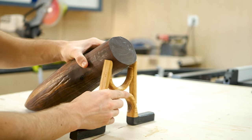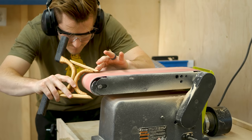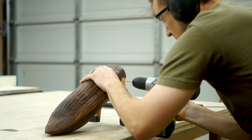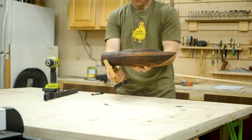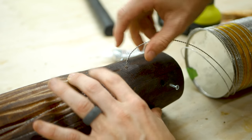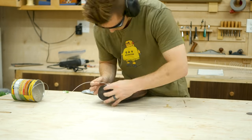Once the finish had cured, I needed to add the wire and assemble the final piece. To add the legs, I first set up and marked out roughly where the legs should go on the piece, and to wedge them in properly I ended up sanding down the interior of the legs slightly, then marking the locations to pre-drill holes. The goal was to use two silver metal screws to complement the metal wire, and pre-drilling was necessary to avoid splitting the really thin, porous nature of white oak. To add the wire, I left in the screws where the feet would eventually attach so I could wrap the wire around it and not cover up those holes I'd need later. I began by drilling a very thin hole in the bottom of the piece just wide enough to fit the wire, then used Gorilla Glue to wedge in that wire, folded it over, and layer by layer wrapped it around the broom, taking my time to be consistent with the pattern. And with a little love, it didn't fall apart — I used a second hole with Gorilla Glue to finish off attaching the wire at the end.